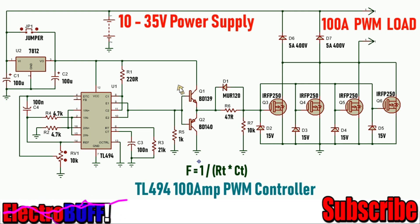The output is taken directly from the open emitters pin 9 and 10, with the open collectors being pulled up to VCC. There is an additional current boost driver based on BD-139 and BD-140 transistors.